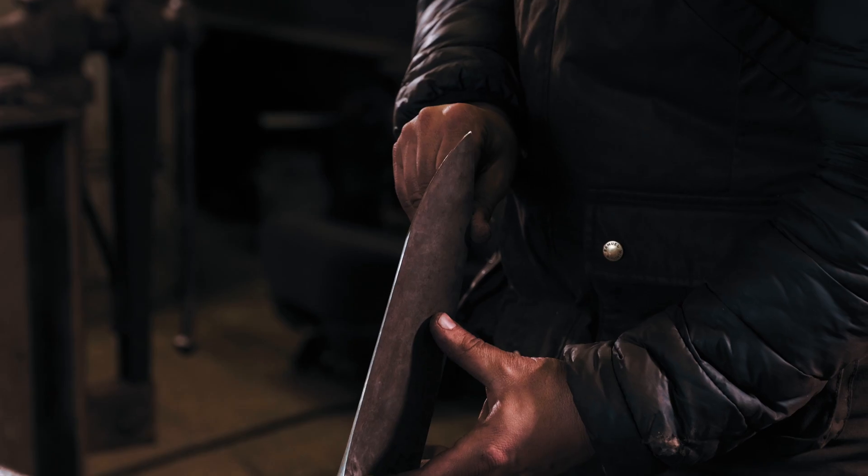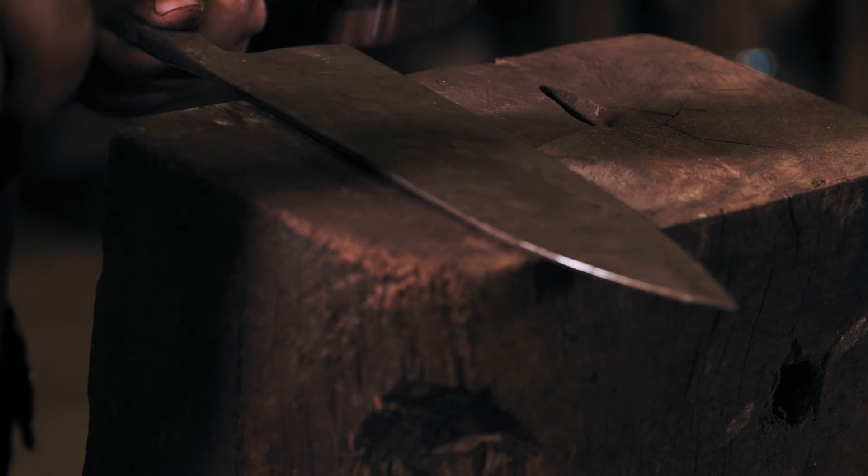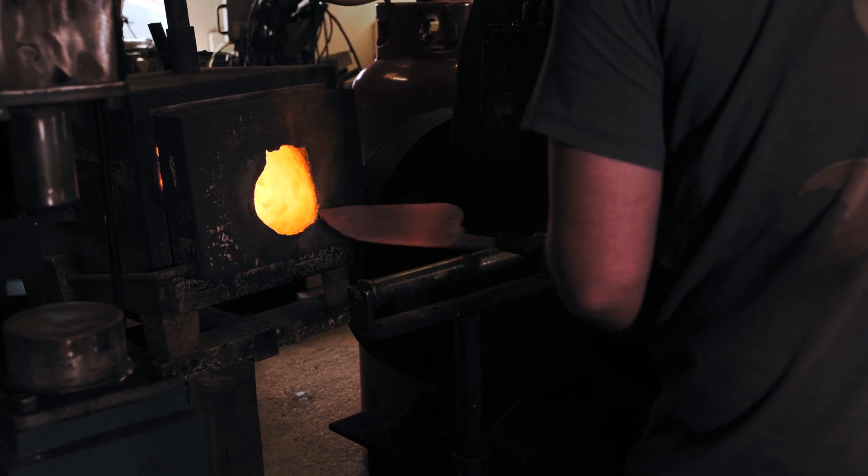People will say grain refinement, and it's definitely true — there are studies done with rolling mills showing cold forging is a grain-refining element. Personally I haven't found any advantage over heat cycling with modern steels. You can actually see it: break a piece of metal that hasn't been heat cycled and you'll see an exploded grain from forging, whereas even just one heat cycle immediately refines the grain, and three cycles gives you about as refined as it can be.